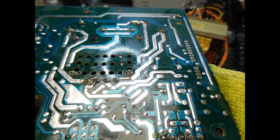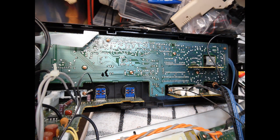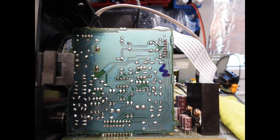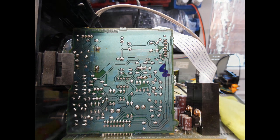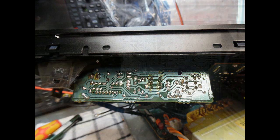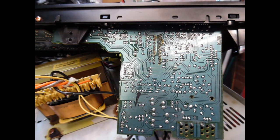Next, I remove the fixing screws from the chassis holding the front fascia and unclip it — there are just side clips. First I concentrate on the volume control circuit board, which plugs directly into the tone board; there will be dry joints to reflow. I then look at the smaller input selection encoder board and reflow those connections. The headphone socket is very important — you'll often find dry joints there. I also check the bass, treble, and balance control boards.